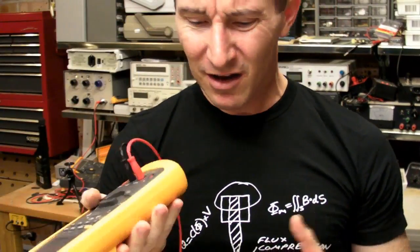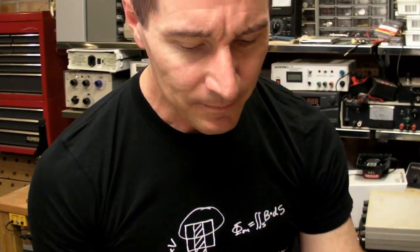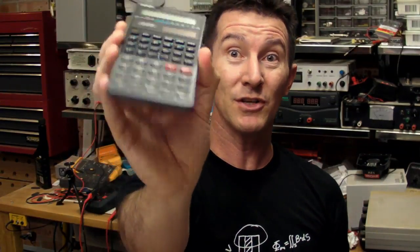If I put my hand over the cell a bit, it drops down. So really I'm only getting under typical conditions, inside an environment where these ultra-low power calculators work just fine, only tens of microamps. Very disappointed — my project just wasn't really viable because the LCD alone would take 100 microamps. Project scrapped right there.